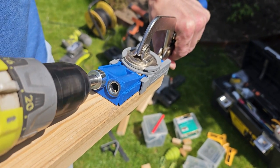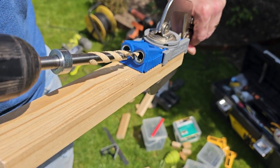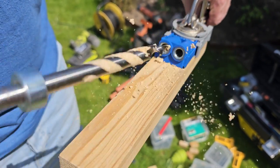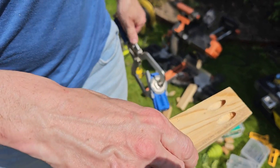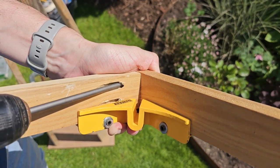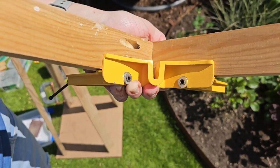You have the little jig like this and it allows you to create two little holes which will then screw into your screws. You place the two pieces of wood together and you create a really solid, stable framework — we use this for a lot of our wood products. Then you can use a little corner vice which holds them together nice and securely, and then screw in your little screws straight through into the other piece to build your frame.